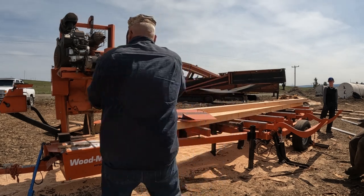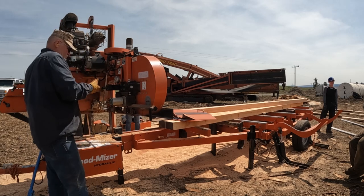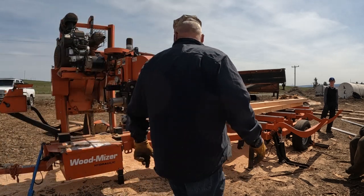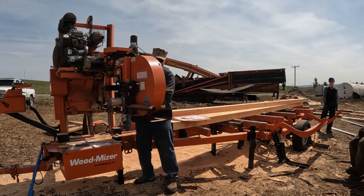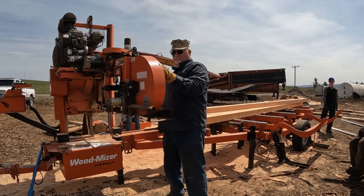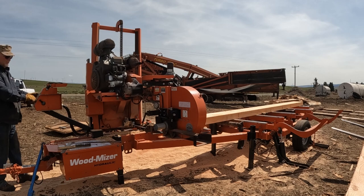Wheel out. Crank the pressure up, get up to 3,000 pounds. You're going to have to run the band a couple times, maybe more. First time, you always check. Make sure your band is sitting properly on the wheels. Put the covers back on. I'm running out of time, aren't I? I'm not going to make it.